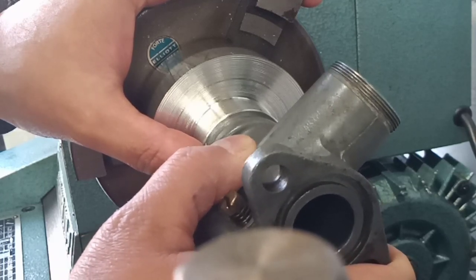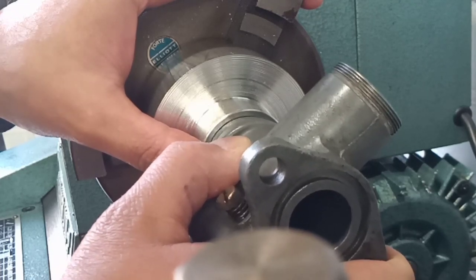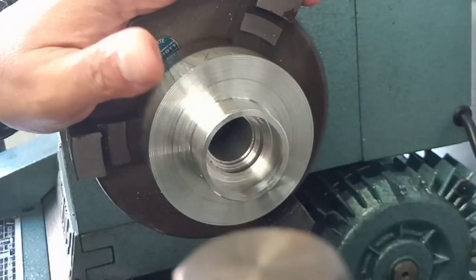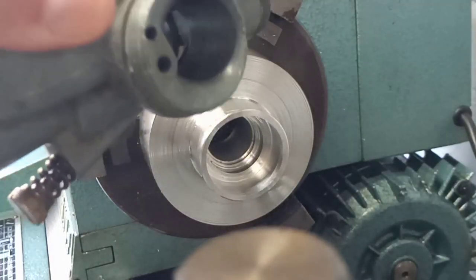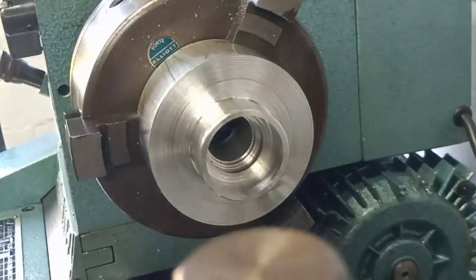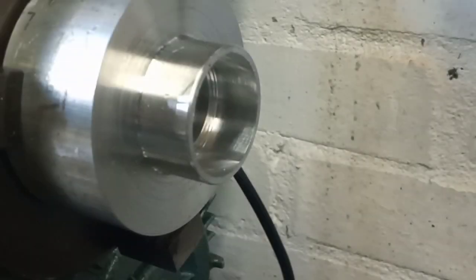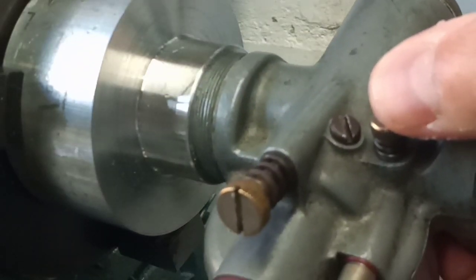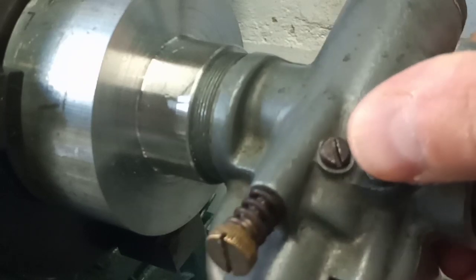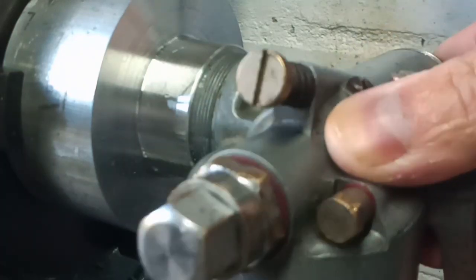I think if we can just get the nose of that slightly unthreaded portion to nose into the hole and cut the thread from there, we're going to be on to a winner. I've been measuring with the calipers — it's not a million miles away from going in. I think we need about another 0.4 or 0.5 and it will snugly go in. I'm basically using the carburetor as a plug gauge, which I think is our best hope. And right — that fits in there very nicely.